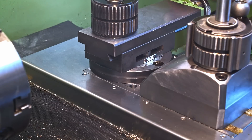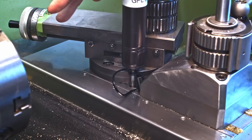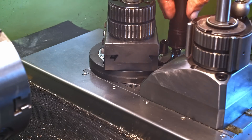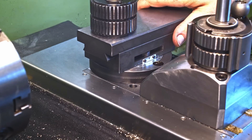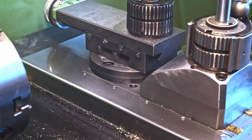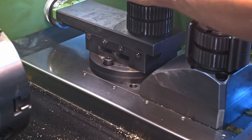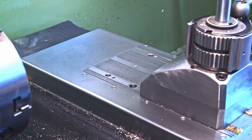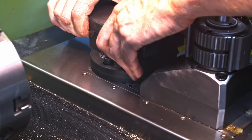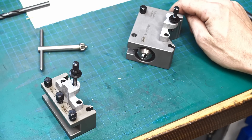This is not a permanent installation — the compound comes off when I don't need it, but I can still reach my lubrication points with the oil gun to lubricate the cross slide. Usually it comes off when I don't need it because it's just another thing to keep clean. To remove it: one screw, two screws, and you lift it off. Super fast, super convenient. So that's my solution for tool post drilling in 2023. I hope you enjoyed this little show and tell — thanks for watching and I'll be back.